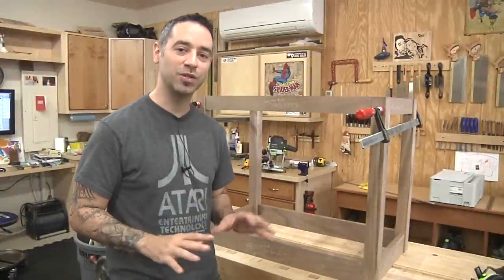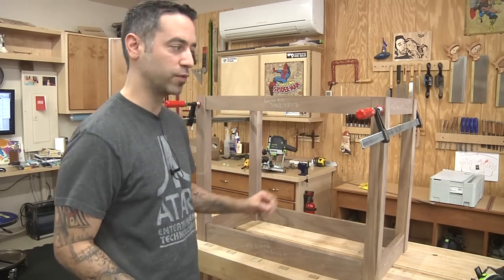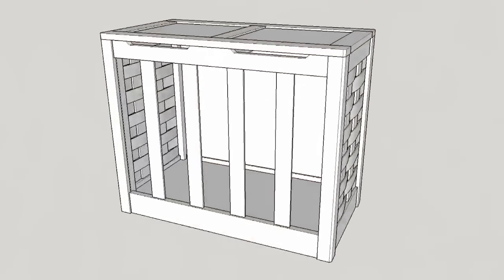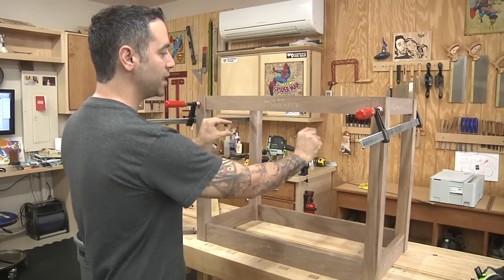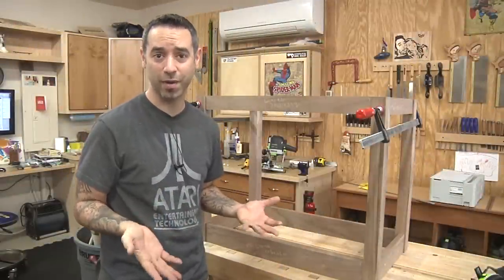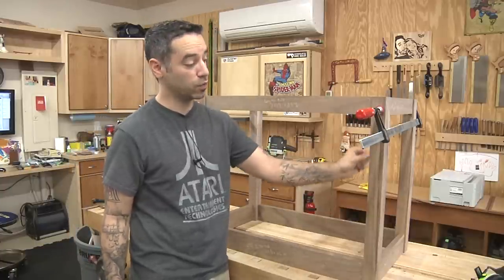Things are about to get really interesting, because these weave panels — not really sure how it's gonna pan out. We'll have one in the front and one on each side; the back is just gonna be a flat panel. Here's the basic foundation: we're going to have four vertical pieces that'll be a quarter inch thick, going into mortises in the top and bottom rails — that's the backbone and the real strength behind the panel. Then we'll weave in eighth-inch thick pieces that will go in and out of those vertical pieces. We'll need a groove in the sides of the legs so those pieces can terminate and go into that groove. That's actually one of the things I'm most stressed about. So we've got to cut some mortises, some vertical pieces, some strips at an eighth of an inch, and then also that groove on the inside of the legs.